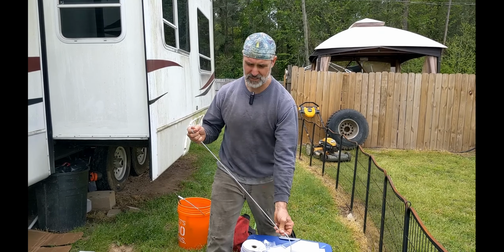Ignore those holes. These little holes here are the ones that our screws are going to come up through to hold this assembly to the block that's already mounted. Drilling bigger holes on this side, because this is the side I send my screwdriver through in order to tighten the screws.